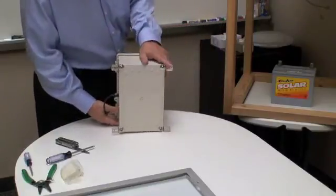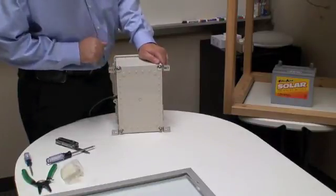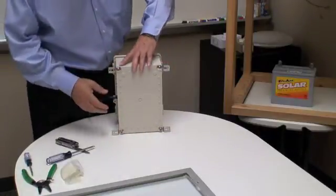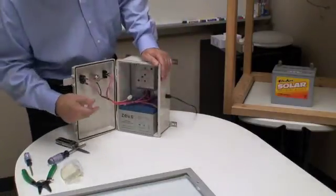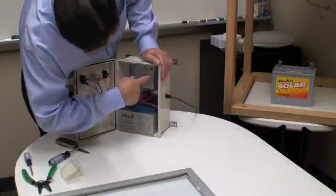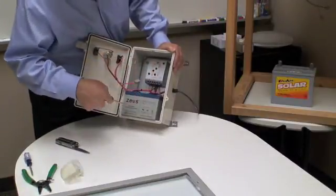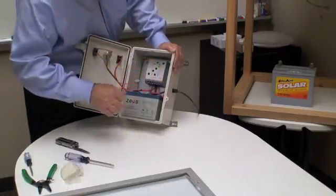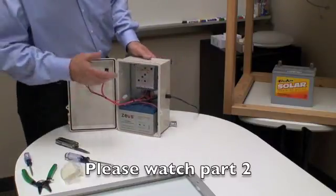If this is an interior installation and you don't wish to use these brackets, you can disassemble the unit on the inside and put holes through the back. You would open up the box and remove the battery and these four screws. If you look on the inside, you'll see four screws and two on the bottom — you'd remove those four screws, remove that plate, mount the box through the back, and then put the plate back together again. That would allow you to mount it through the back.